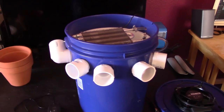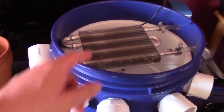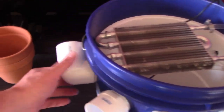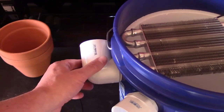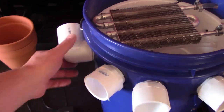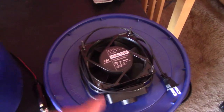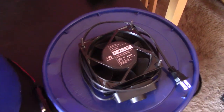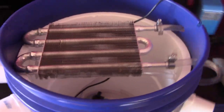Let me give you a quick recap of the unit. The original unit had four air inlets with the couplers. The only real change since the last video was I added a fifth air inlet — went with a 90 degree elbow for no particular reason, just looks kind of cool. It needs the five to get a full, perfect airflow with this particular fan. It seemed like it was bottlenecking at higher speeds, and when I added this, much smoother airflow now.